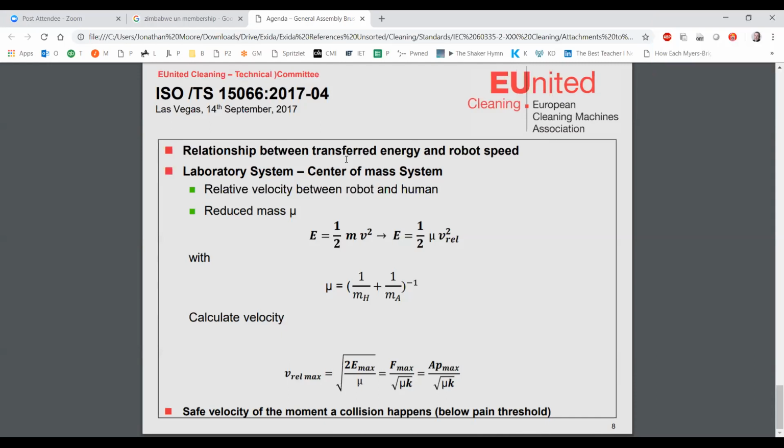Normally I would say I turn it off and that would be the end of it. But today I saw an article about a mother who was pinned and her 18-month-old was killed by a tractor that was powered off. So it rolled over them. Certainly if you've got some level of autonomy connected to it, farms are dangerous. You need to make sure it's isolated as well as powered off. It's the only way you can be sure, really, especially when you're modifying the brake, which obviously you are to allow it to move.